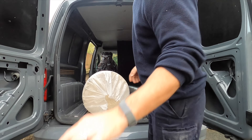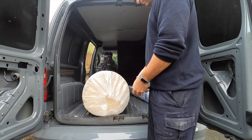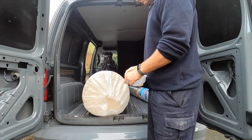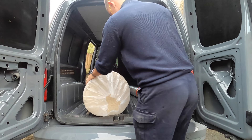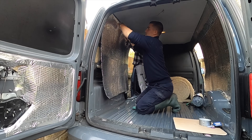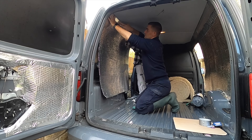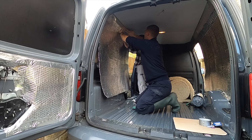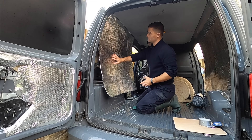But I did keep hearing three things again and again. First, insulation is about air gaps. Second, don't use fibreglass wool — not only is it bad for you if you breathe it in, but if it ever gets wet it just turns to mush and you have got to rip everything out and redo it. And finally, with the insulation, put it everywhere — everywhere you can.